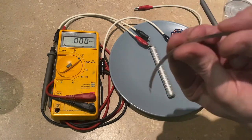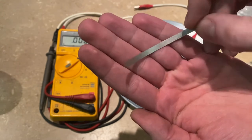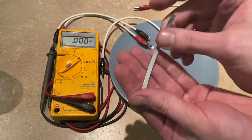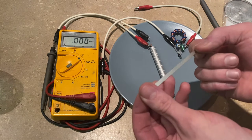This is what that magnesium strip looks like. You can see by the surface already it's a kind of rough surface, pretty porous, with a higher amount of surface area than if this were a polished strip. When you receive it, it'll be coated in some kind of oil, so make sure to clean that off. I used isopropyl alcohol.